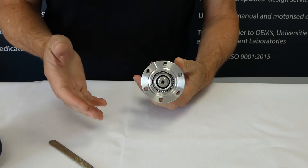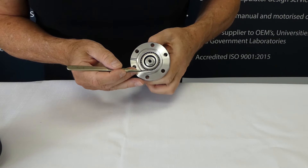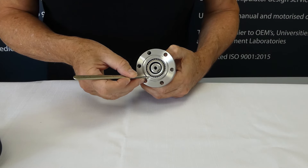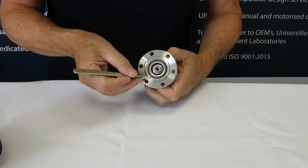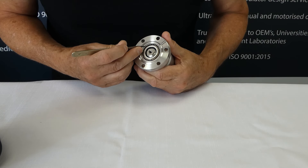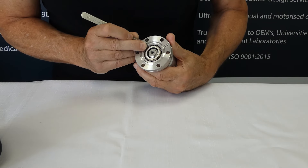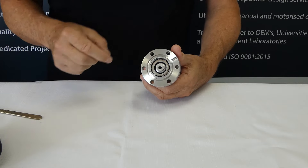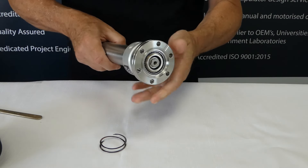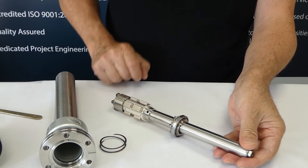Of course if you are using this for a new vacuum system you would be using gloves to do this. On the end here, if you look very closely, there is a circlip and here is the end of the circlip which is just a loop. What you need is a very small screwdriver, or what I am using here is a scalpel. If you use a scalpel you have got to be very careful, but a scalpel just gets under the clip quite easily. So we have just removed that, making sure you don't catch the knife edge — it is not easy to do. Once the first part of the clip is out it literally peels out and you can just pull it out. That is what the clip looks like — it is just a spiral clip. Now if you tip it forward you can pull out the assembly. The front bearing comes out with the assembly because it just knocks out on the back.